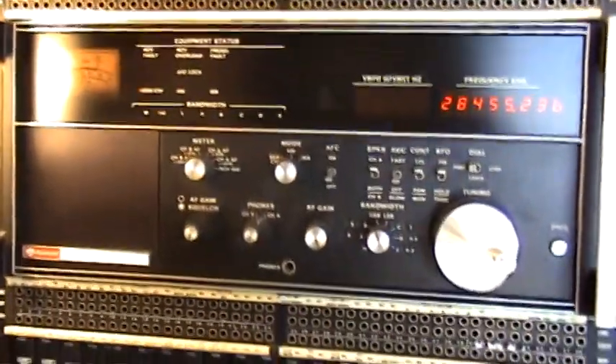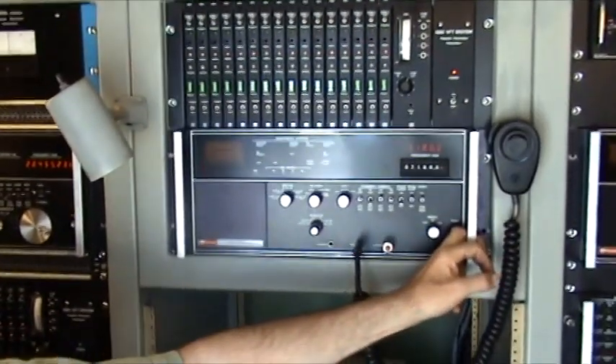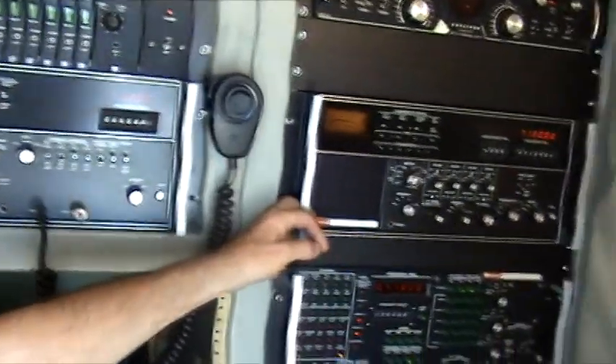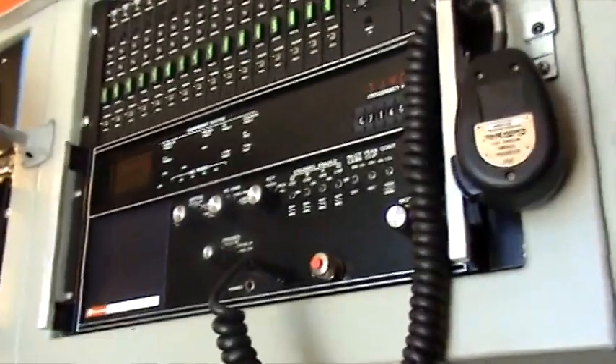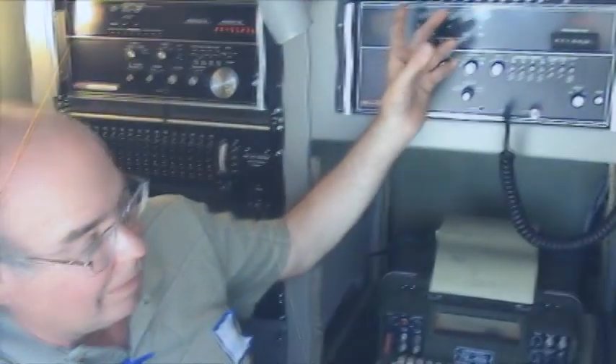Give us a brief rundown here from left to right — explain what all these modules are. This here is a tunable HF80 receiver, 2–30 MHz, which I just have for hunting around. It has a separate antenna. This is the exciter, the HF8014A — the A means remote controllable. And then this is the receiver, the HF8054A. So we have the receiver, the exciter that puts out 10 milliwatts, and then the 1-kilowatt solid state HF80 2332 amplifier, these two boxes down here. On the back is a coupler and a 32-foot whip. When you touch the key, it turns on the transmitter, tunes the coupler, and boots you right on that frequency.